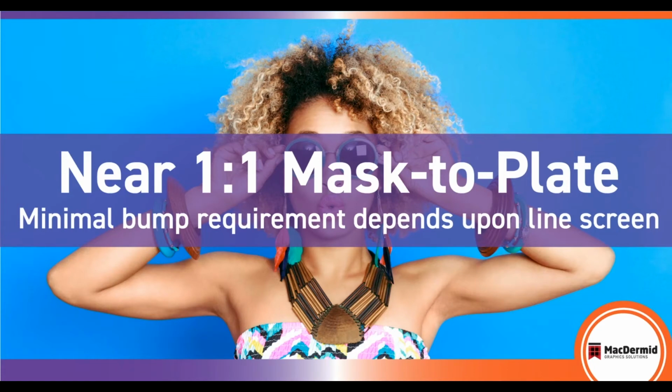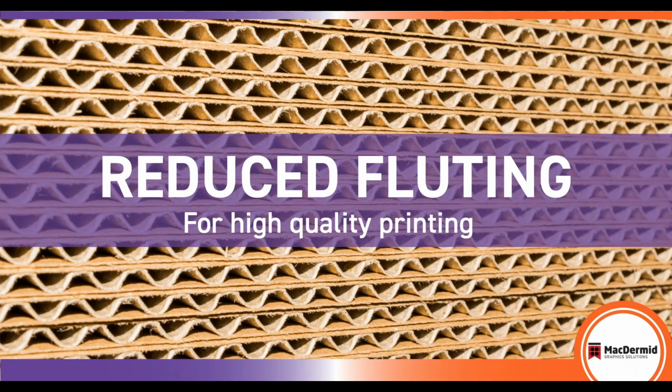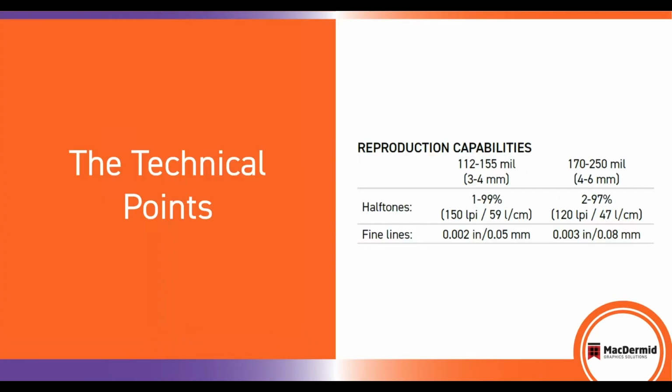This imaging package allows for nearly a one-to-one mask to plate reproduction with a minimal bump required depending upon line screen, and is typically not required on anything up to 120 LPI. This flat top dot structure allows for reduced fluting for high quality printing. And here are the reproduction capabilities of this new plate.